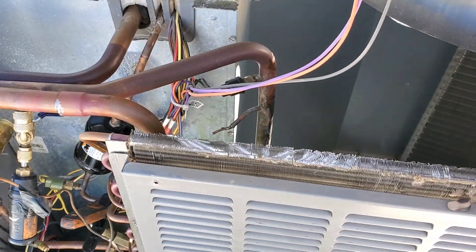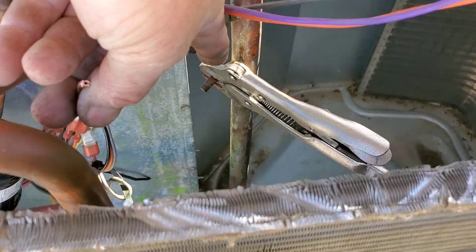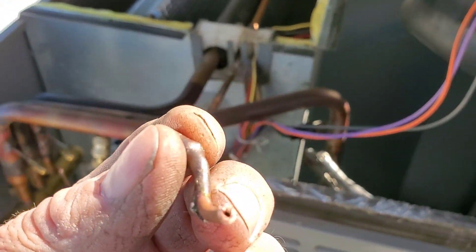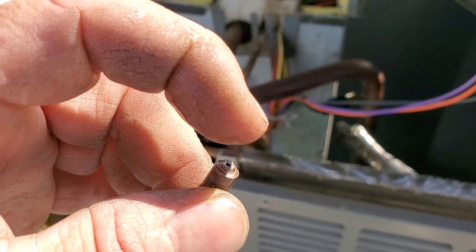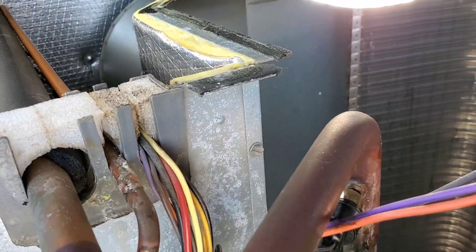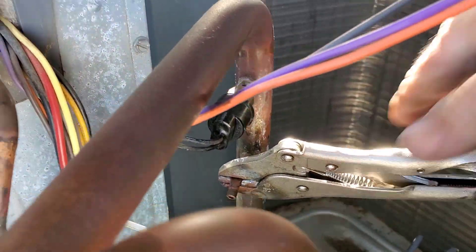Check it out — using a pinch-off tool. When I have the pinch-off tool on that line there and then I cut it, I had pressure trapped in here. So it wasn't coming through there, and you can see that's pretty wide open. Interestingly over here, I don't see a blob right on the end. It might have broke though — there was a piece left in there. It looks pretty wide open. If I loosen my pinch-off tool, it's not restricted any further.